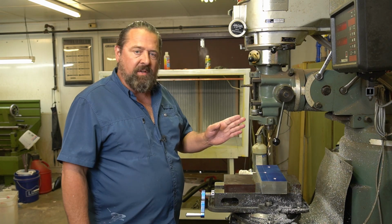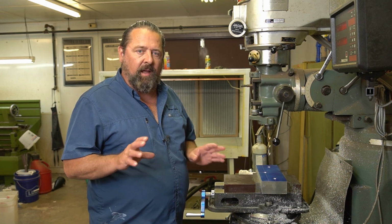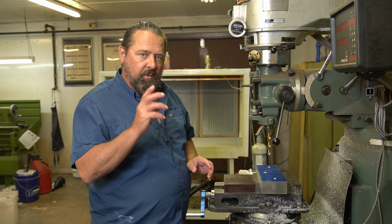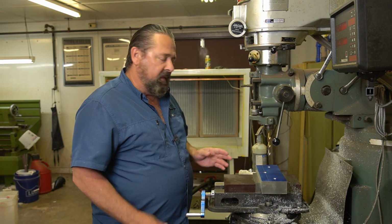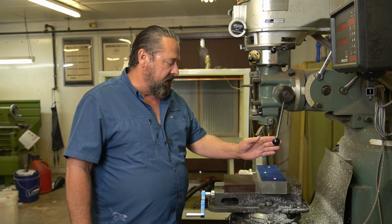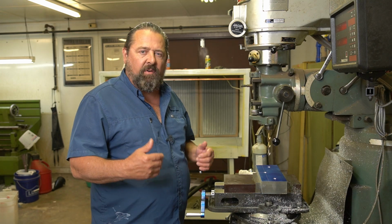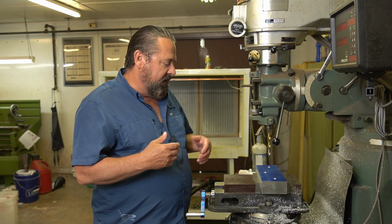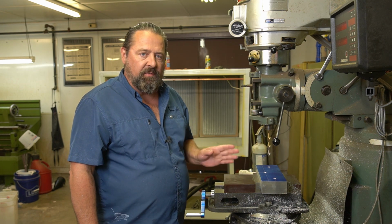Now, let's go ahead and get with this. I cannot stress enough how much easier it is to go off of 0 from the center of your part. There's a lot less numbers to deal with. You're always going back over 0. So basically, you're remembering the same number for both the right and the left side. That's another reason why I always make 0 center of the part, especially when doing these. It's just easier on me, it's quicker, and I've done these enough and things like them that really there's no beating that, making 0 the center of your part.